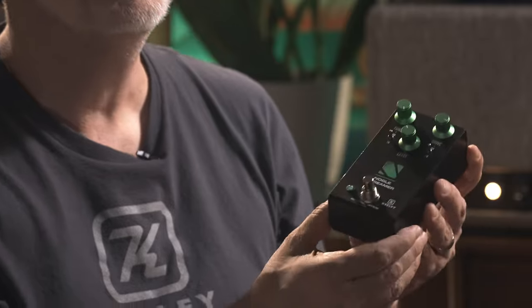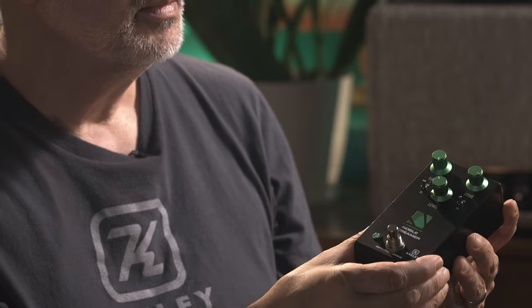They're not exact clones of the pedals — we had to move things around to capture what people expected them to feel and sound like. I started by putting each complete circuit for the two familiar sounds together in the pedal, with dual pots controlling it. That allowed you to explore what makes each of those familiar drive pedals sound the way they do, and what happens when you look at each half of them independently. You can think of it like amp modeling — taking a preamp out of, say, a Fender.